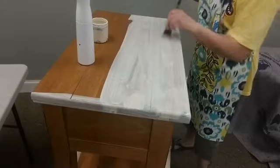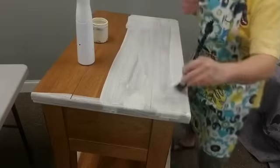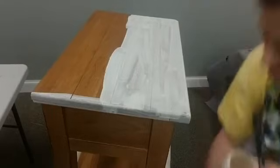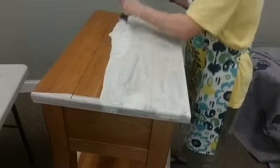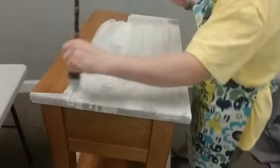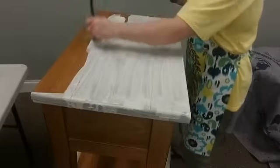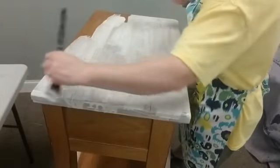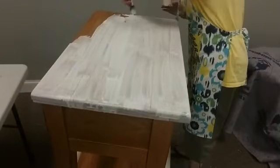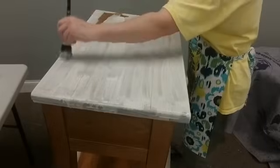I've heard some people say you start with a darker base and layer on light colors because that gives you more depth. I think it's six of one, half dozen of the other, but if you like starting with a dark base, by all means do it your way. I just know what I want on this piece because I've already done the drawer, and I'm going to start with a light base — first thing I want to do is neutralize this brown. There's not really a lot of thought process to what we're doing. Just wanting to get a little whitewash coat on this. Make sure you don't have drips — you don't want to drip all over your floor.